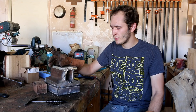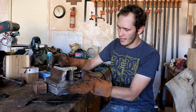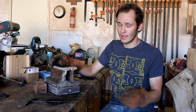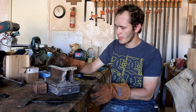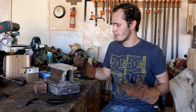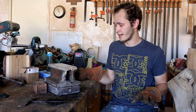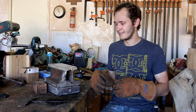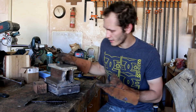In our last video we welded together an encasement for the bottom of the anvil at the base and poured lead in there and welded everything shut. Since then I went ahead and ran some more beads around and filled up any small holes here and there. Also, in an attempt to pre-warm it up, I'm hopefully going to be able to heat this whole thing up and melt some lead inside and maybe pour some more in — but maybe that's just wishful thinking.